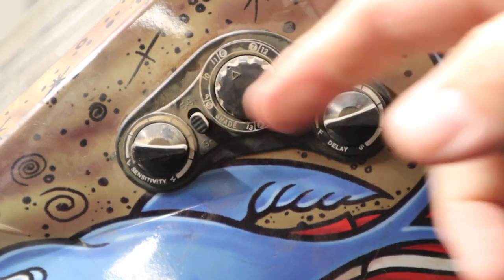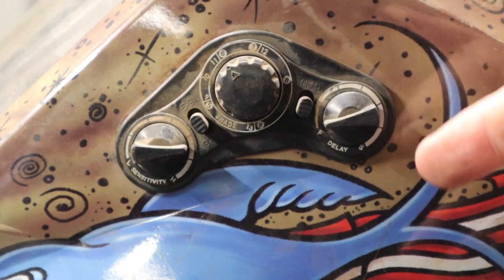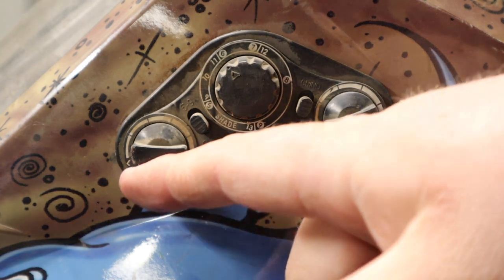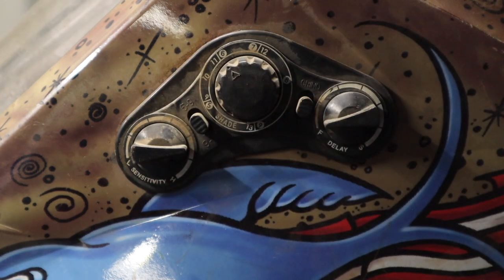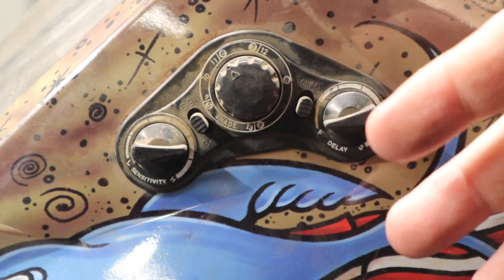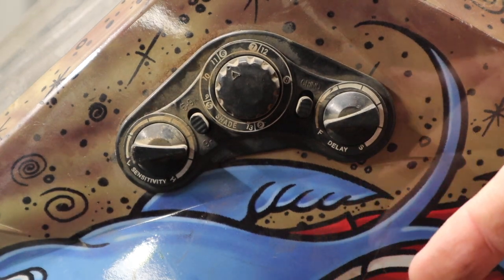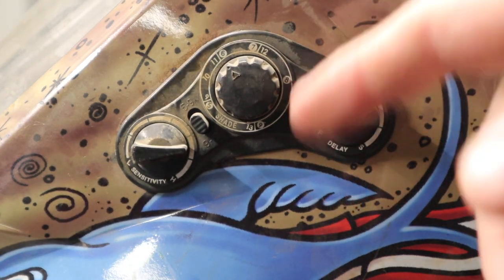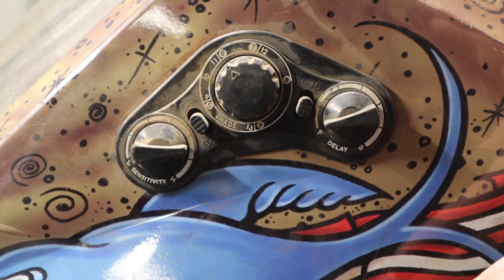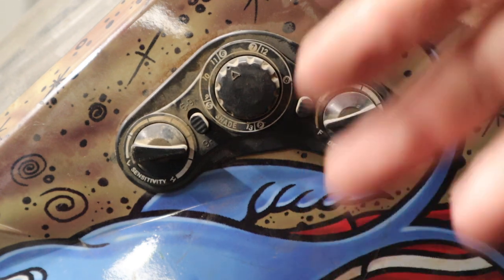On the side of the Iron and Ink you have all your controls on the outside. These control panels vary by brand and version. On this one you have a sensitivity dial, which makes the sensors either very sensitive or less sensitive to any flash — mine is turned up high so it even activates with grinding, which can be a bit annoying. Then there's a delay dial, which controls how long the helmet stays shaded after you finish welding or end the arc.